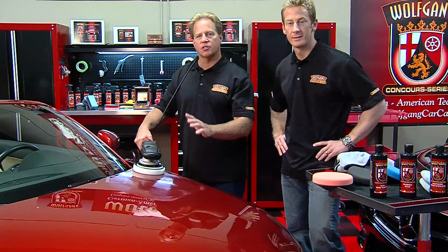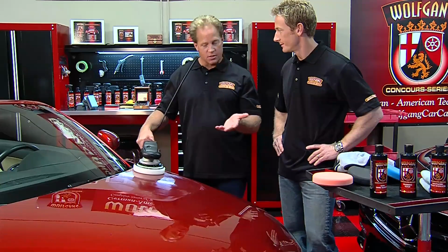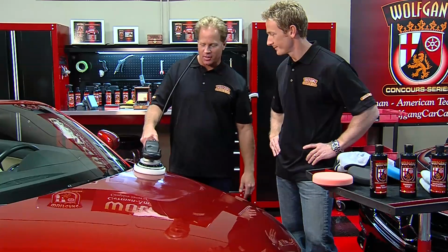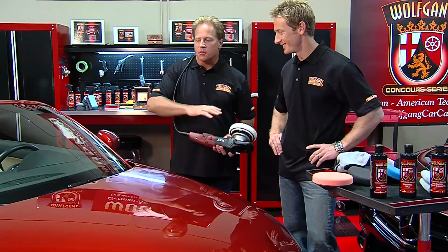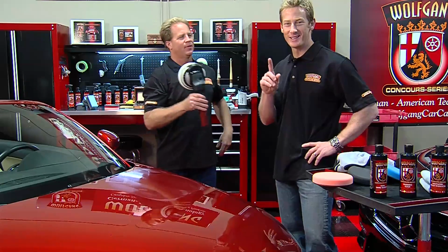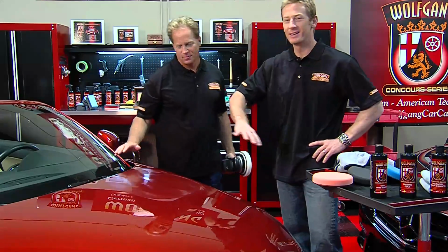Okay, I went over that section 6 times. That's called 6 section passes. Notice I didn't lift this off till that pad stopped spinning. Now I'll lift it off, and again, that keeps me from throwing splatter everywhere. It's that mistake that you learned the first time, and hopefully it's the last time, and it saves you that hour of cleaning up all that splatter.